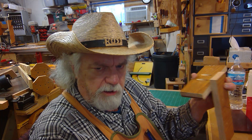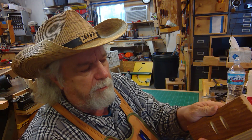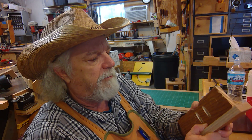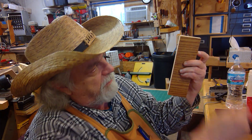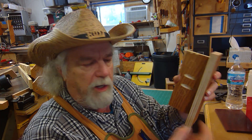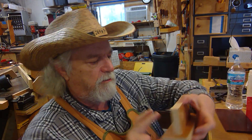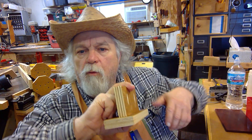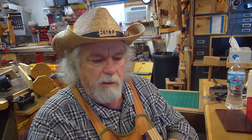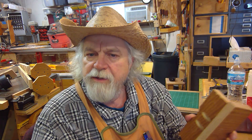The strongest joint is actually putting pocket hole screws on both sides. If you put the piece of wood here and take four screws — two from this side, then stagger the other two on this side — what you now have is the old Norm Abram trick of toenailing, only with screws instead of brad nails. And the screws will hold even stronger than the brad nails do — a screw is going to hold a little stronger than a brad nail in most scenarios.